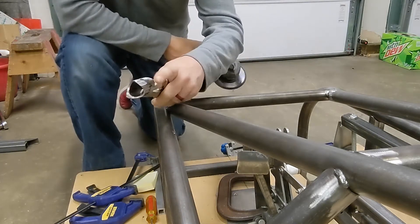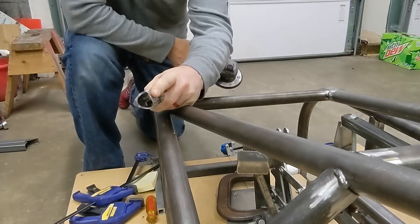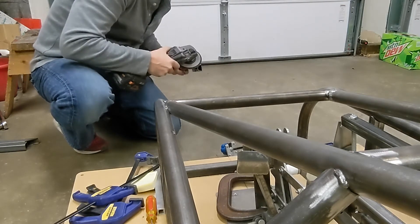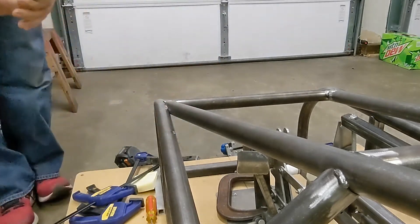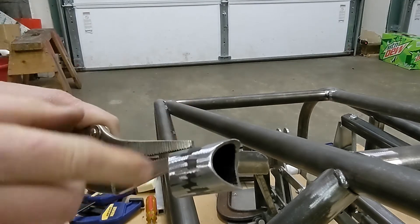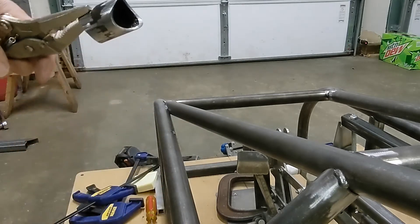What I'm actually doing is going through and grinding off some of the mill scale to make sure we're down to clean bare steel. That's all for welding — just to make sure we get a really good bond. Here is the finished piece cleaned up. I'll usually come back through and round over that edge just a little bit. You can see I ground down the thinner areas so that we have more material when welding to bond everything together.